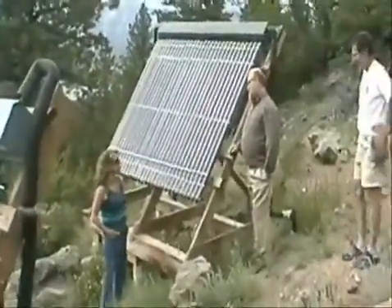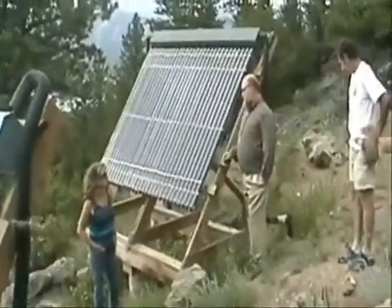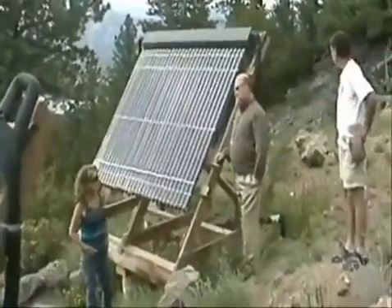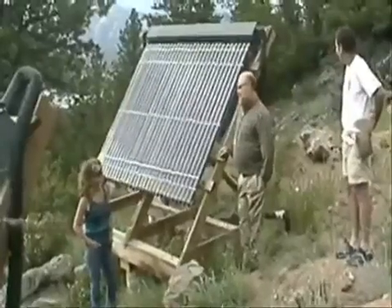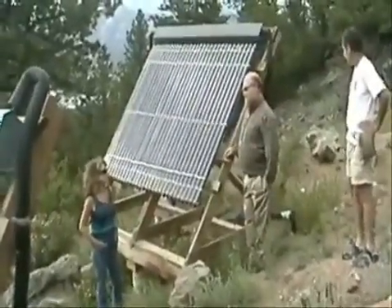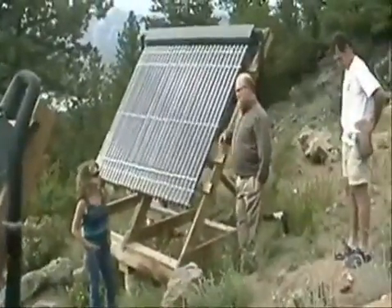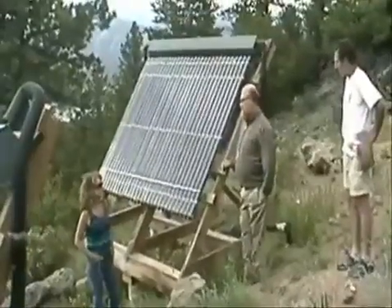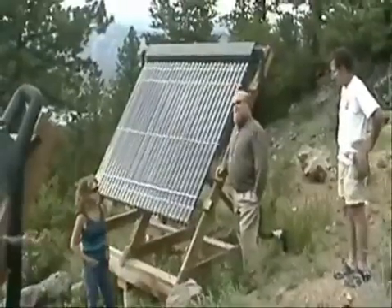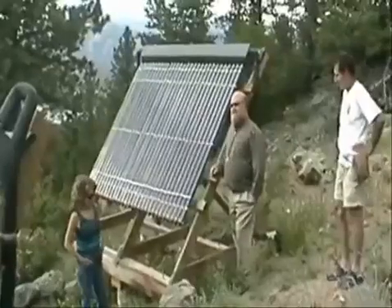How do you heat all your hot water with this? Not all of it, but it does. In the summertime it's probably almost all of it. In the wintertime I'm also preheating the in-floor hot water system and the hot water. The instantaneous hot water heater works really well with solar because it can boost the temperature. If I only get the solar tanks up to 100 degrees, it can boost it up to 120 or 130, depending on what temperature you have your hot water set to.